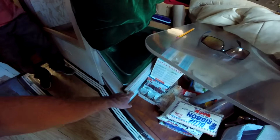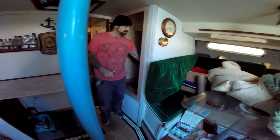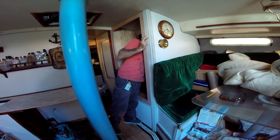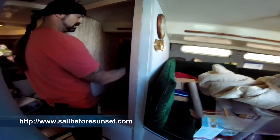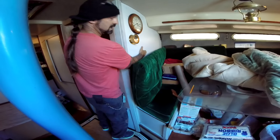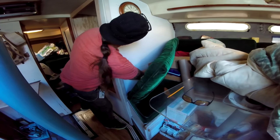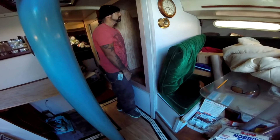What concerns me right here is this seam — it's kind of like a wedge. What I want to do is cut and put a piece of marine grade plywood, just a square right here. That will give two pieces of marine grade on the side. If we run the screws through the wall we can break them off and cap it with the mahogany. This particle board here is sticking out — it's bowed like a boat — so when I put the piece of marine grade I'll try and screw it so it pulls back together.